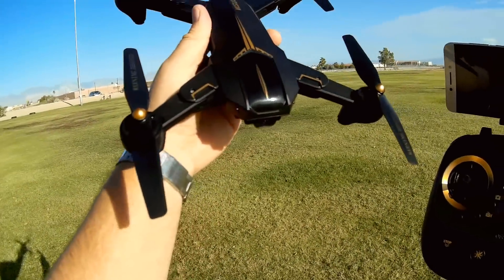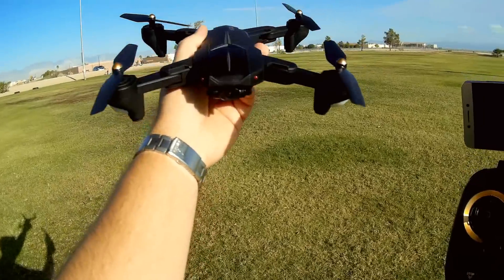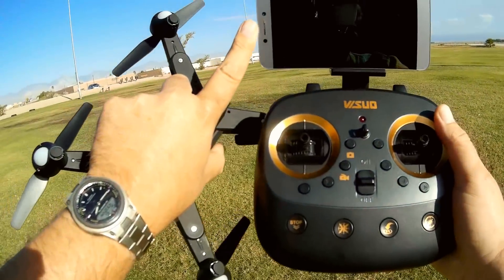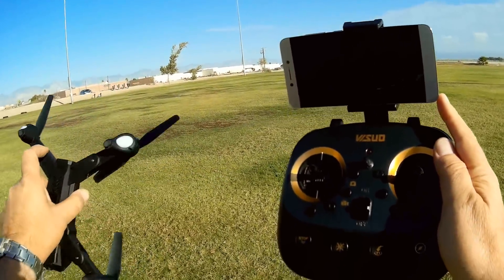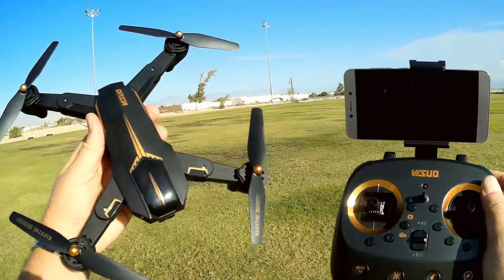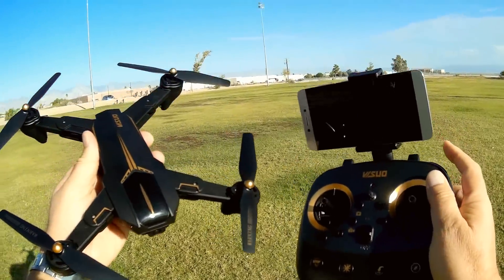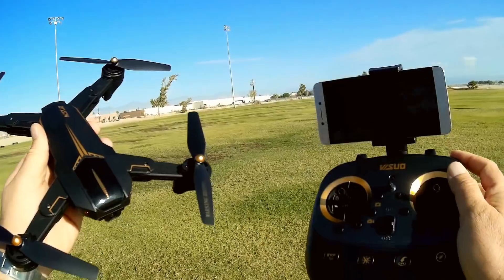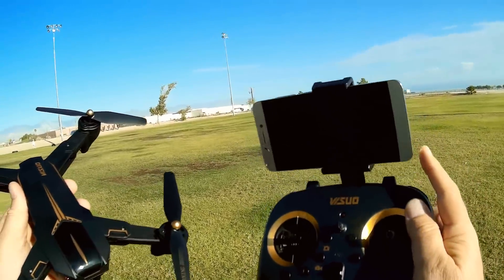The XS-A12W includes GPS. So now we have a GPS-controlled drone. With that GPS, you have follow me and also waypoint capability — true waypoint capability from this drone. It's a Wi-Fi FPV flyer, but it's 5G Wi-Fi, 802.11ac Wi-Fi. Not everybody has 802.11ac — not all phones have that. So before considering purchasing this drone, I strongly recommend that you verify your phone is indeed 802.11ac Wi-Fi capable. Just type the name of your phone in Google along with 802.11 and see what comes up. If you see 802.11abgn, that's not going to work — you want to see 802.11ac.